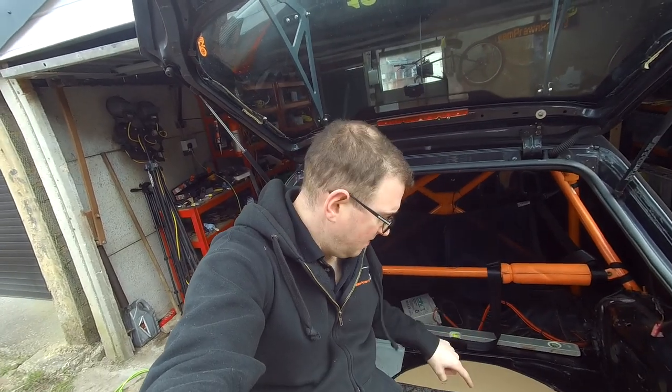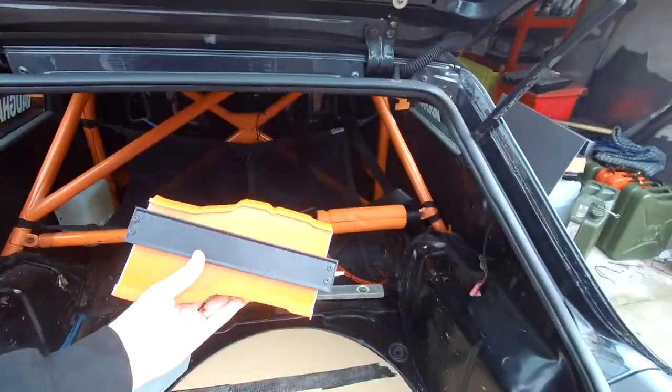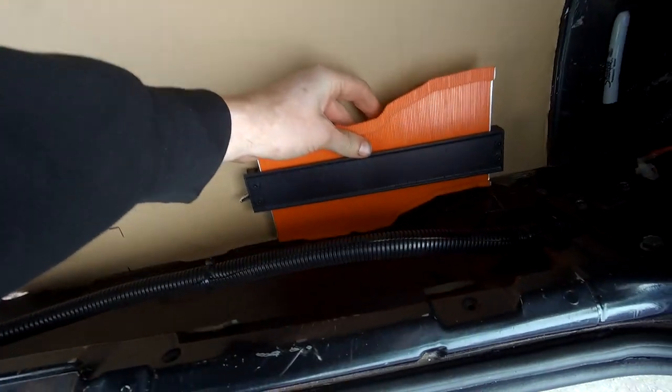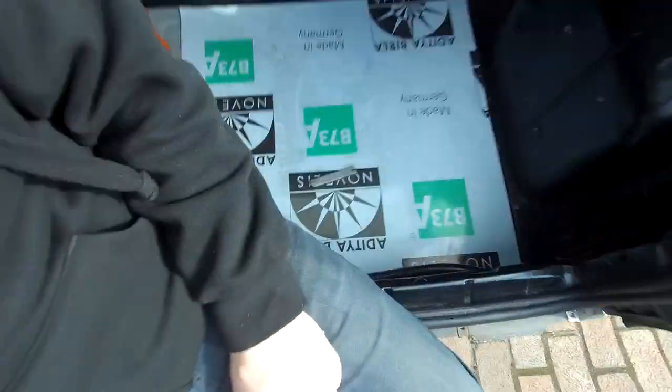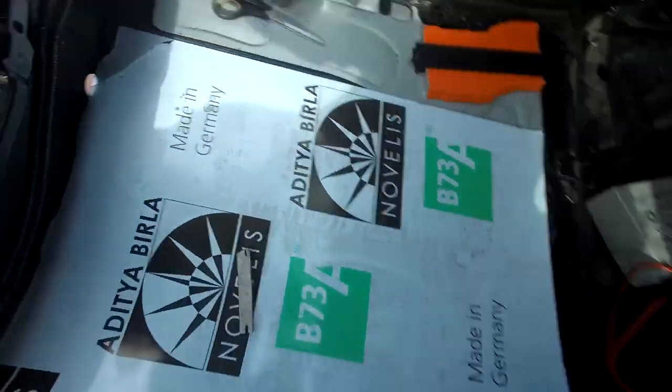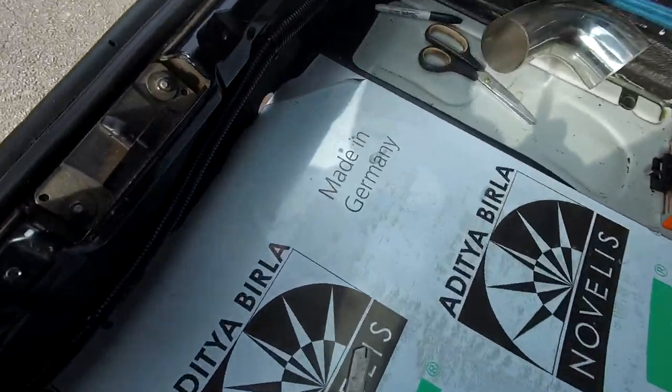Next up is filling the hole. So we've got a sheet of card in there. I've actually used my contour gauge to pan across the back panel to get the profile — so that is the profile of the inside of here. I've done the easy bit, I've made the plate which is going to go in here. It's all profiled to the back there but the tricky bit is I'm going to try and put an upstand on the back here. If this works it'll be a case of riveted in; if it doesn't, it'll be over to you for ideas.